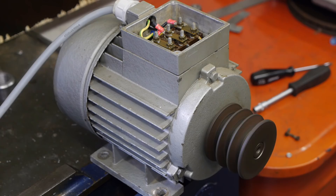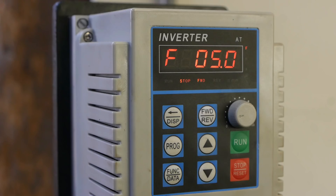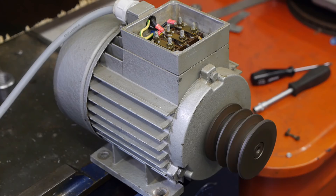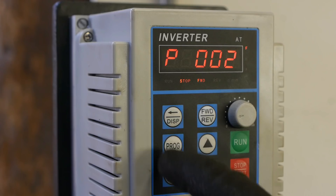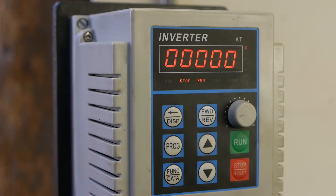For now I will keep the rusty pulley — I don't think the vibration is coming from the pulley, but you never know. So I thought I'd try increasing the torque compensation parameter from 50 to 72 to see if I can get some more power out of this motor, but to my surprise the parameter defaulted back to zero. So I set it to 75.